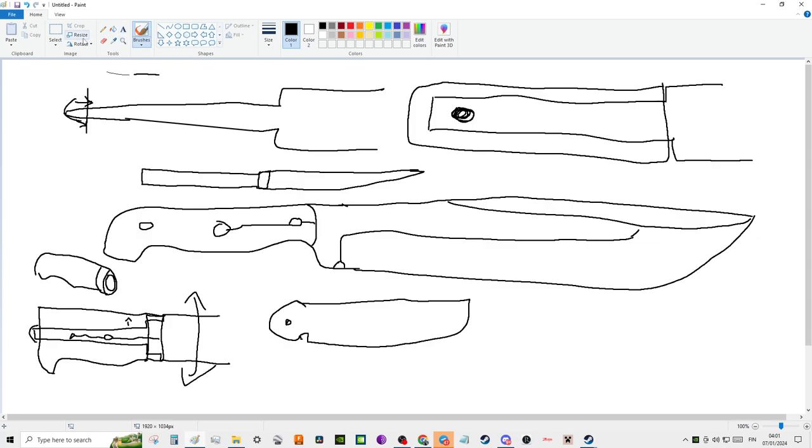So when you're really heavy into knives and you're a real knife nerd, you don't need to be so strict on, oh, it has to be a full tang, right? You really don't, because it's not necessarily true that the full tangs are the toughest. It really isn't. And often the heat treat is where a lot of people mess up, because what they'll do is they'll often heat treat the blade up until here, and then none of this is heat treated. None of the handle is heat treated.